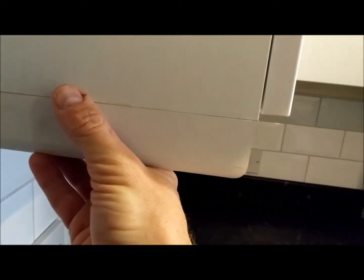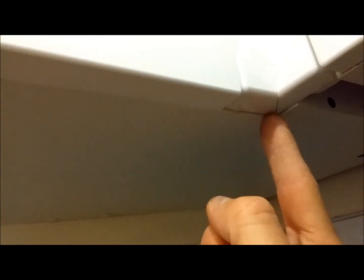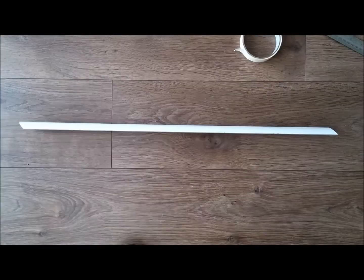Offer the pelmet up, and you'll see if I push it all the way back I've got a very slight gap. At this end, that will give us a little bit of adjustment room so we can bring that right up to the corner and meet the edge of the other piece. Measure the length from there through to there. In my case, I need to measure up to that corner there, because there's a corner trim in there. When you measure, remember to add on enough for the 45-degree cut that will go away from this corner. If you measure and cut square, you will not be able to put a bevelled edge on there.